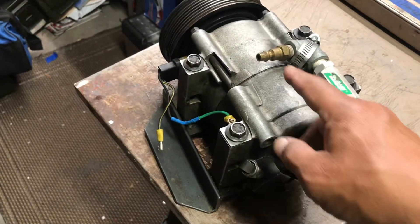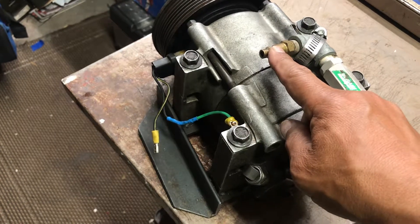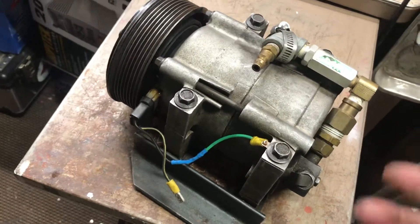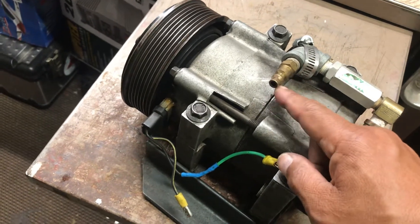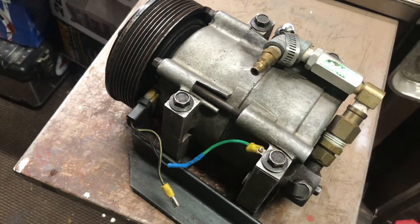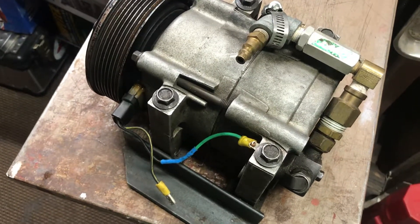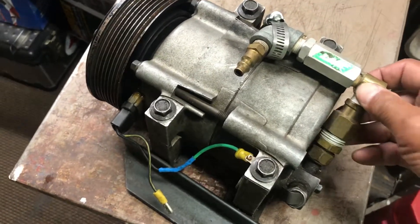The simplest way is just this, but you'd have to have an air valve that's continuously flowing. If you want it to shut off at a certain pressure, you need to put a regulator in here. If you're just filling up air in your tires, there's no need to regulate it — you can just let it pump air all the time. Just make sure you have a flow-through filler fitting so it doesn't build up pressure. If you want it to build up pressure, you'll have to put a regulator in, and I'll show you that later.